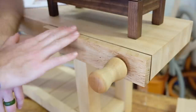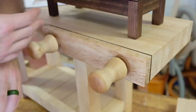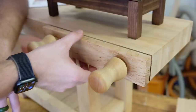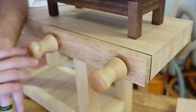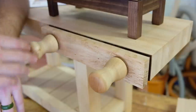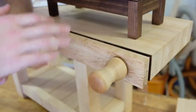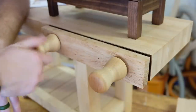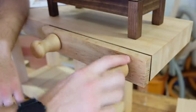I believe this was the first project I did using my new mini workbench — half novelty, half useful for me. This twin screw vise was pretty helpful. What it does is raise the workpiece up off my normal work surface, much like a Moxon vise, which is very popular. That way, if I'm drilling dowels, cutting with a small saw, or using a small block plane, I can keep the material up closer to my body so I'm not bending over and hurting my back — which can happen during repetitive batch work. I did feel a lot more comfortable doing that type of work. The screws are a little too snug as you drive them home, so I might add more wax or trim them down, but that's a project for another day.